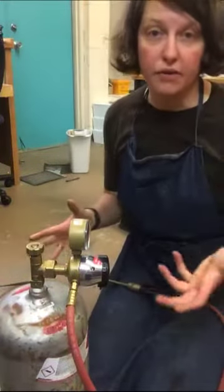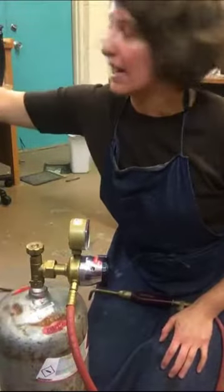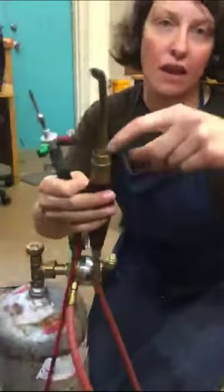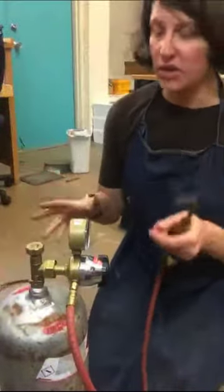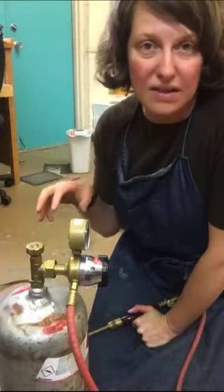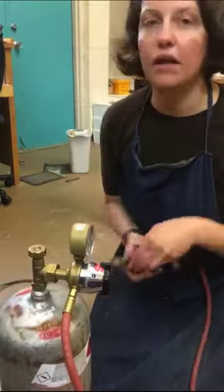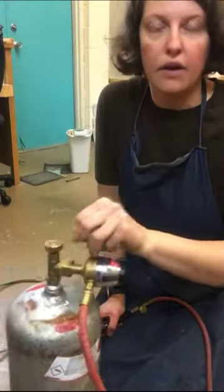Dee asked if I prefer propane or acetylene. Well, I use both. Acetylene burns hotter — that's confirmed. I know that this torch is teeny tiny versus this other torch, which is like a monster in comparison. This guy actually burns quite a bit hotter and cleaner because it also has oxygen in it. Versus bringing in the air around us, it's bringing in that super concentrated oxygen, and that helps it burn hotter too. For my Little Smith, I like propane because I don't get those little black wispies as badly with the acetylene. For this torch, I don't get those because it's already mixing with the air, and this torch is designed for acetylene, so I have to use acetylene with it. A lot of torches — depending on which one you buy — you can pick which gases you want, and it's all very dependent on which setup you get.